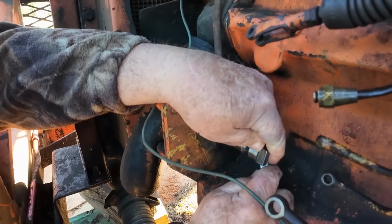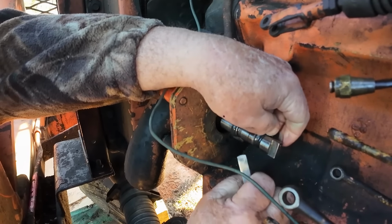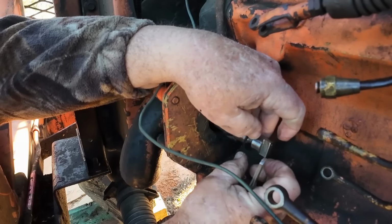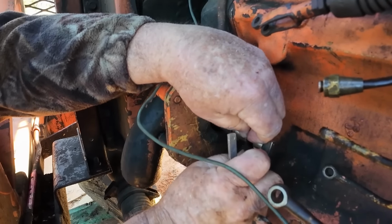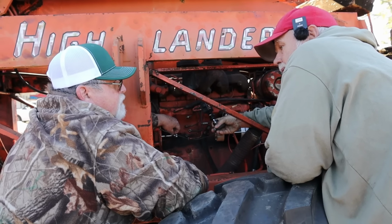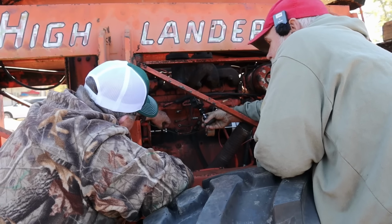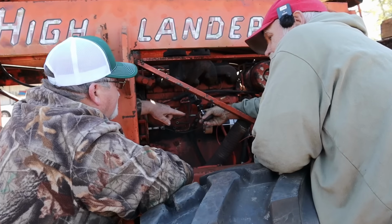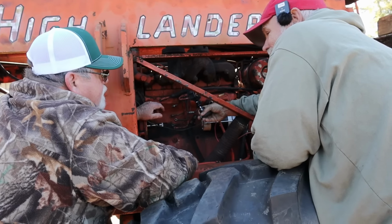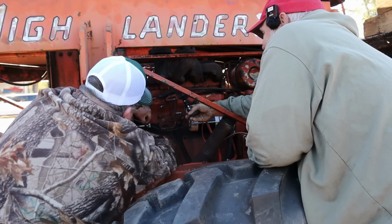Did you tell me that all injector pumps on John Deeres that you've dealt with have that? Not all of them. The newer ones, like these, do. The 450s, the 350s are a little different. Like that one older pump, like I was saying, it was built different, where you timed it with a timing pin up right here in the motor. And he told me just forget about that, and it worked. First time I'd ever put one on like that. But the rest of them are like this when I got this tool.